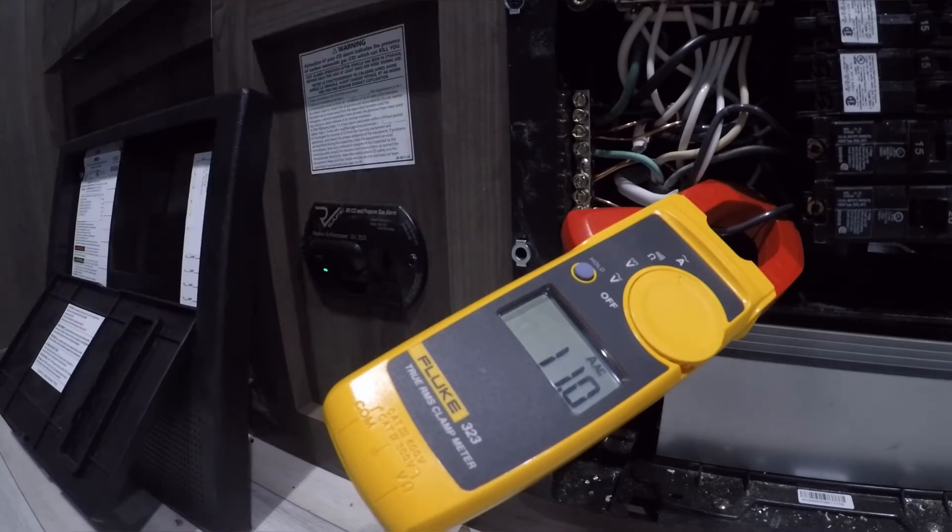There's a perfect logical reason why you could hit the surge protection on generators — some may hold a slightly stronger tolerance. That was a 50-amp spike. So if you have a 29-amp maximum surge protection output and you hit it too hard, that's going to set off the surge protection in your generator. Not to mention it will be hard on it, especially in auto setting where the AC is cycling on and off.